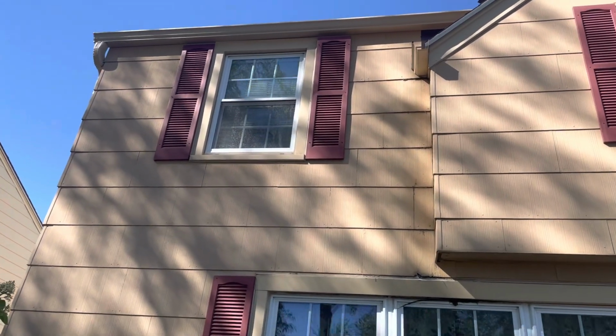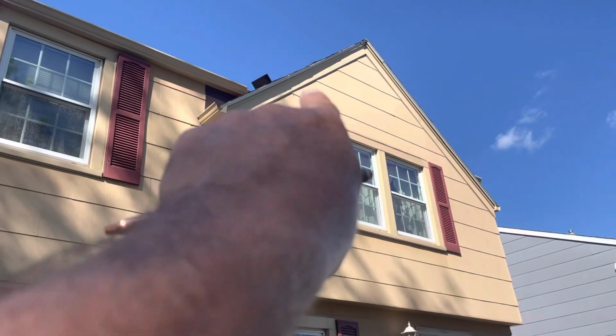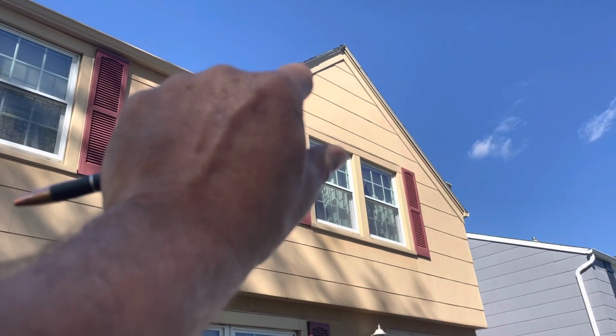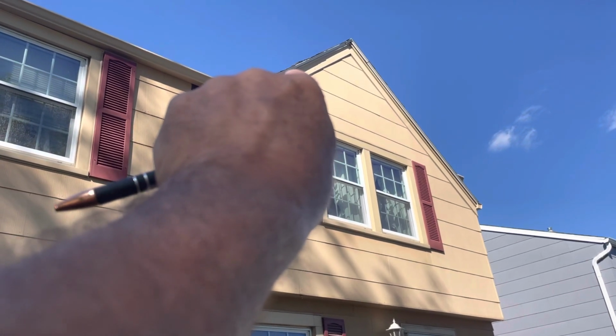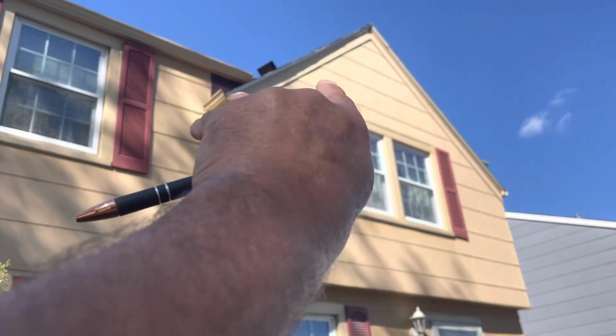And then, I've got another video. We're going to create a diverter, they've got that little diverter up on the roof. What we're going to do is come up about 1.5 inches high with some thick 027 gauge brown facing out. Going to tuck up underneath the shingles and onto the drip edge and run all the way down to the gutter. So any water that hits there is going to come down.